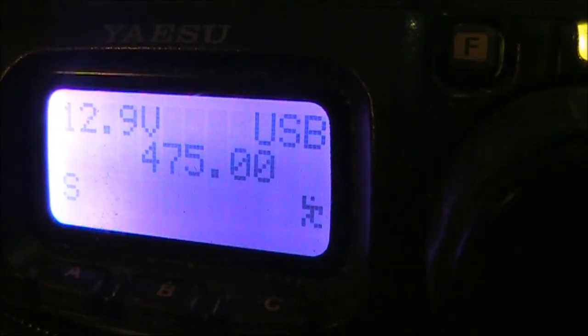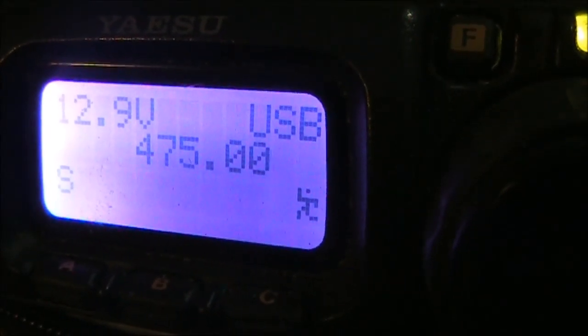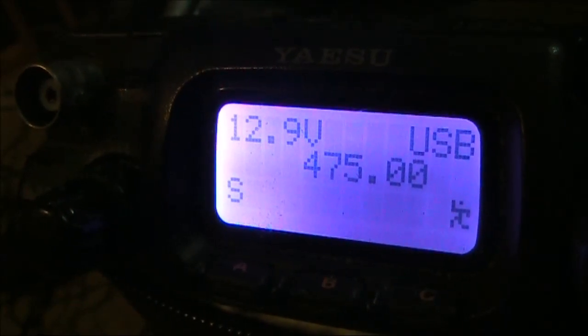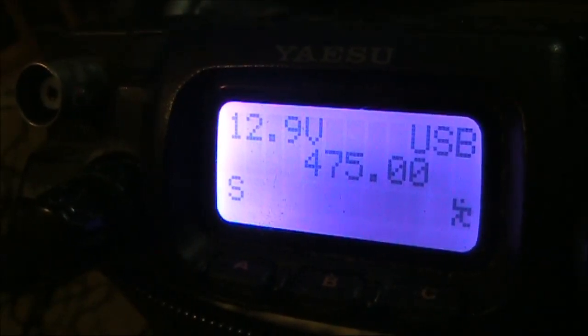It's a good idea to monitor your transmissions. The FT817 isn't a very good receiver on 630 metres, but for this application it's fine. It picks up sufficient signal even without an antenna connected, provided your antenna — in this case the radiating feed line — is close enough. The signal strength you hear on the FT817 depends on where you've got it tapped, and it can provide some guidance as to where the best point is. Then you can use your field strength meter to get a finer indication.